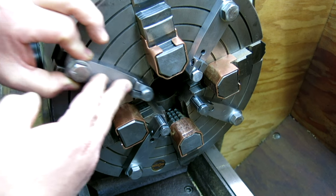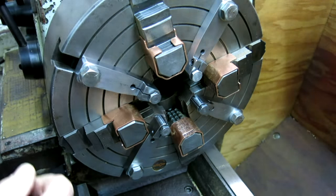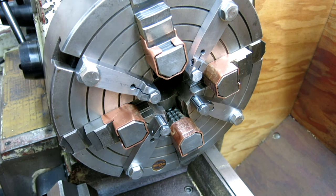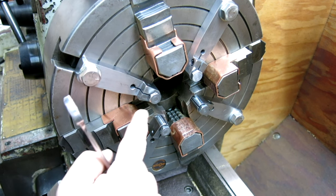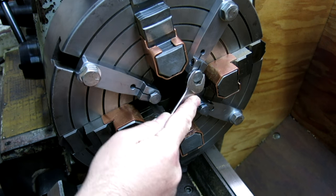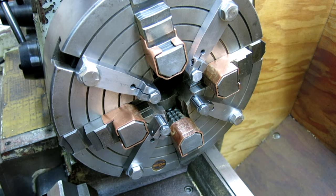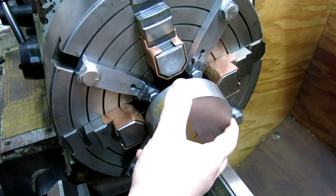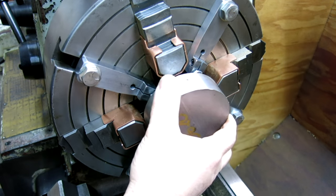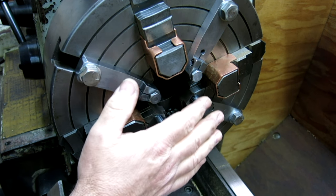You can see these are positionable for radius. I'll just set this one here, lock the transmission, snug that up. And then what we have is a series of adjustable screws. You can turn these — it has a little clamp mechanism. The idea behind all this is many times you want to hold a thin disc or a narrow slug like this, and you want to project it out towards the tips of the jaws.